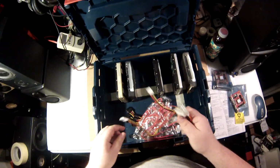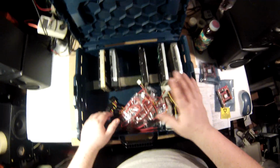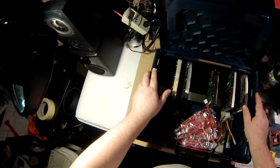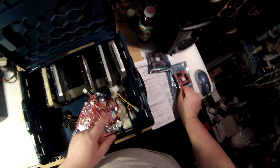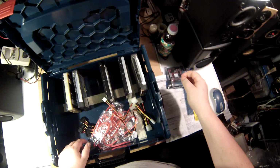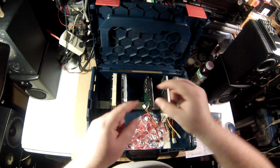And I was looking for... I don't know if anyone on the YouTubes can help me. I found one... Well, Cheese found one, honestly. Cheese. This is partly Cheese's. eSATA out of this to a USB 3. Because I want this to just be USB 3. A plug and play. Now, I found one that is 2 eSATA ports in. It's a board like this. Two SATA ports in and 1 USB 3 out at full speed.